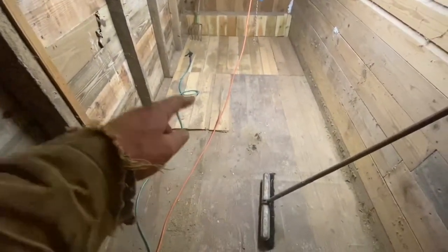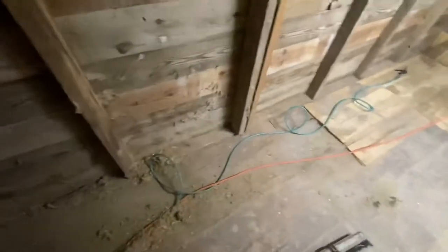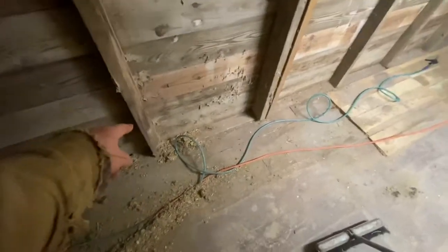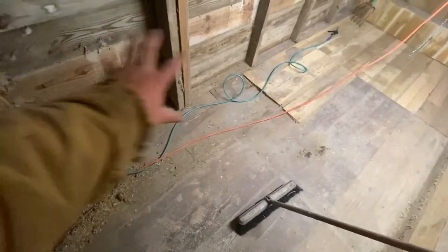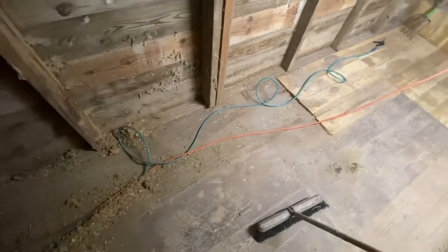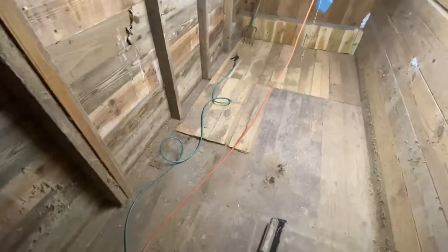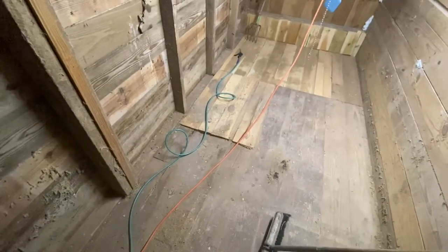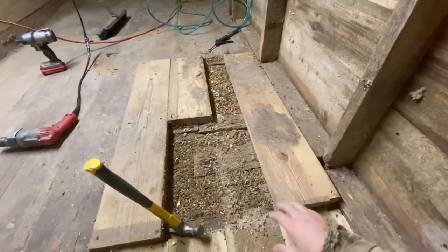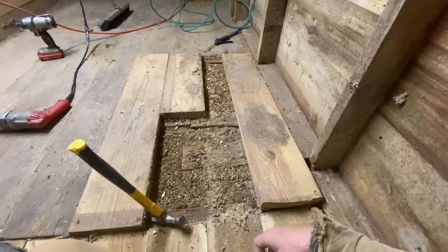Okay, so now I have this cleaned out. I'm noticing that these boards were ones that I replaced a while ago, and they're raised up. And I'm thinking of having the brooder come out this far and do two of those spans, so it's longer and skinnier, and I need to replace those boards. So I'm going to try to rip up that part and use the fence pickets so that the floor is a similar height. So I'm pulling up these boards, and these cross members are pretty well rotted, so I'll replace what I can there.